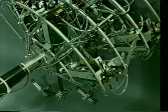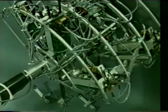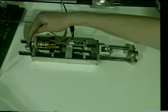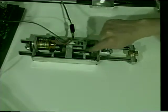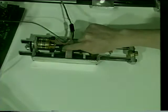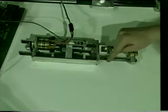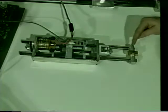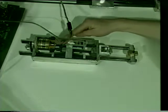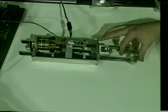Six identical series elastic actuators in the body provide power to the joints. Series elastic actuators allow for good force control and shock tolerance. The actuators consist of a motor followed by a timing belt reduction and a ball screw. The ball screw nut drives a block which pushes on four compression springs, which then push on the output shaft. The actuator is attached to a cable which goes around an idle pulley. A linear potentiometer measures the spring deflection and provides feedback for a force controller.